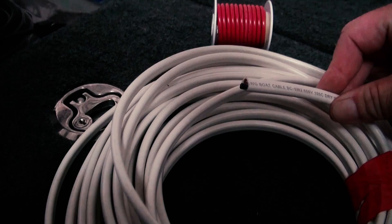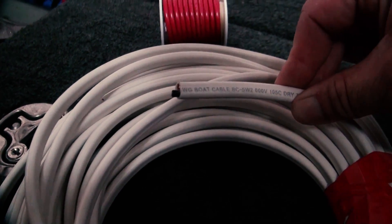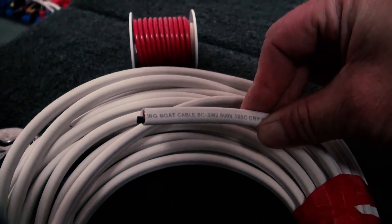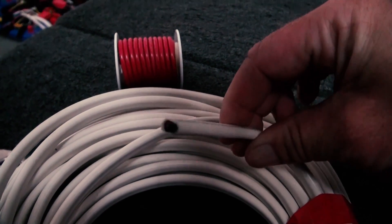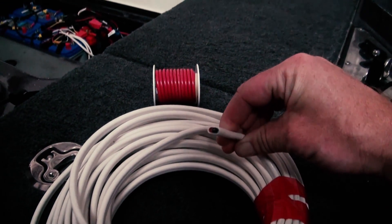The third thing is making sure that you have large wire on your unit. If you have to extend past the Humminbird factory cord, make sure you run a minimum of 12-gauge tin copper wire. If you're running longer distances — say six, eight, or ten feet — you may even have to use larger gauge if your distribution panel or battery is farther away. You don't want to have that amperage drop.